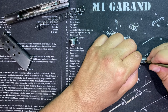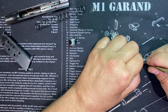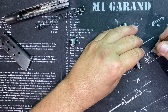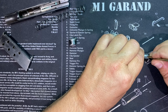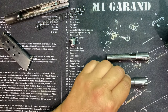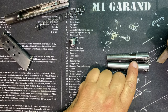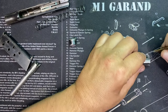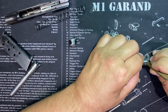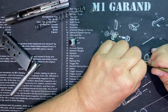Now all we've got to do is just file it enough to make it smooth in and out. Let's use this. This is one side digs deeper. It digs harder than the other. Again, though, let's not get ahead of ourselves here. Let's make sure. How deep does this channel go, too? Oh, it does go deeper, too. See that? It's deeper, too. Maybe we'll go a little deeper just to really square that off. And we'll go a little bit further towards the locking lugs too.